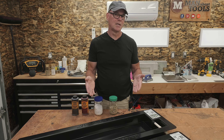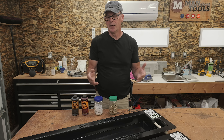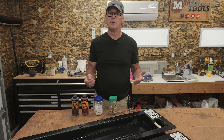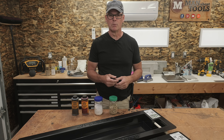With the panels from the plastic forms, there's a draft angle on the edges that affects how they mate to each other — it's just something we have to think about when stacking them. Also, I'll be prepping my molds in a new way that's different and I think better than I was in the first plastic forms video.